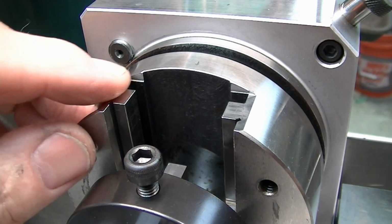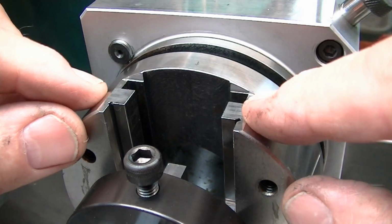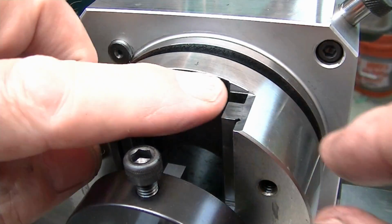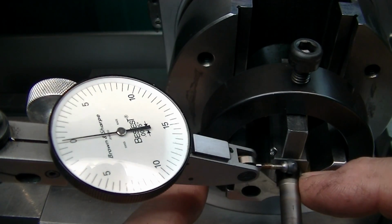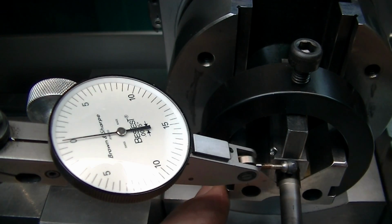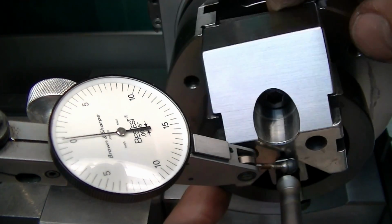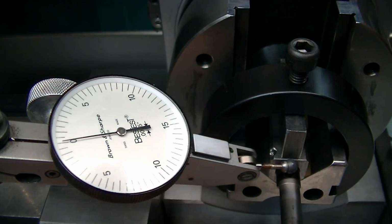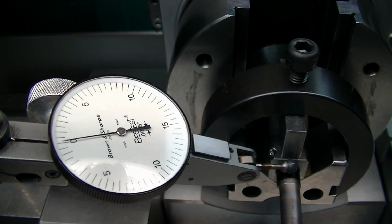On this punch grinder, I have intentionally ground a flat surface here that's true to the axis of the punch grinder, where I'm going to sit my indicator. So first step is indicating in the round shank, because that's my reference for all of my offsets. So I adjust my V-block up and down until I've got 0, 0. And in this case, we're not talking about tenths here. This is just relief cuts, so we don't have to get carried away.